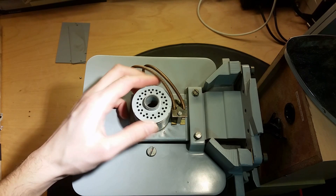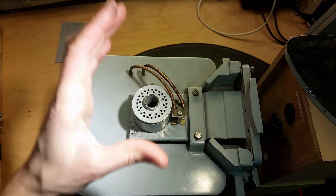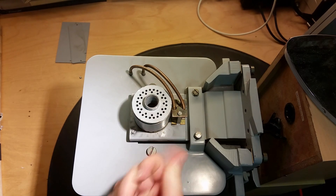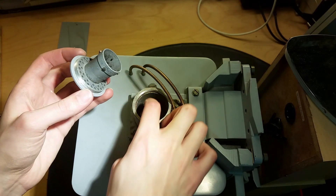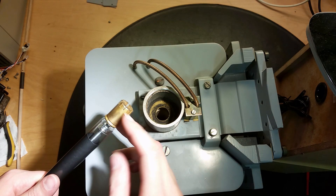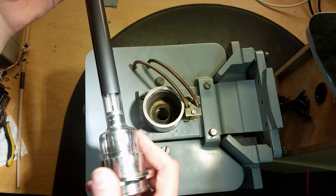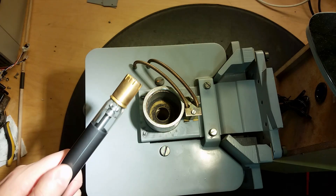Here's the back of it. We got this collector here. I think it was force air cooled - we got the cold air going in here and blowing out of these holes on the top, and got some holes on the bottom here as you can see where the air came out. It just took a bunch of scrap and dust. Let's have a look in here - it's a bit dusty. So the air should go in here, going around the collector and out of these holes. This part got pretty warm - all the power. This had like 20 to 30 percent efficiency, so all that 70 to 80 percent would be dissipated in this one. It should be pretty warm.